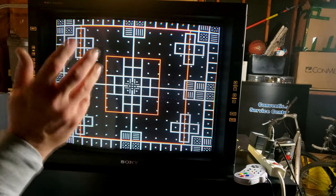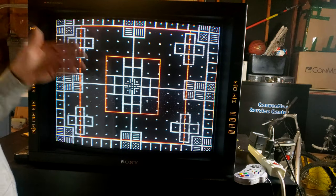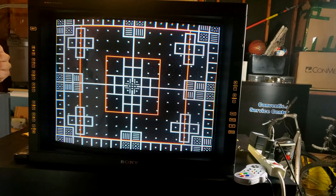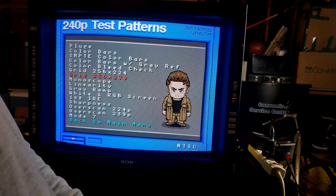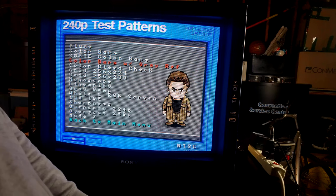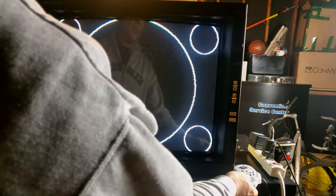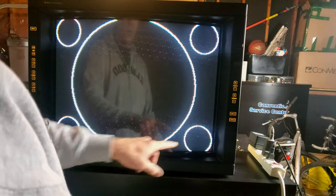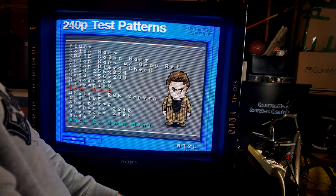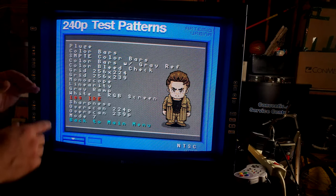And so if you're going to be looking at your geometry all day, this is not really the best monitor to have for this. Another reason is it's so difficult to make an adjustment like I showed you by taking the shell off and then adjusting those potentiometers. But this is what I would consider a well adjusted screen here. We'll look at some other things. You'll notice a little bit of issues here, just not the greatest pin controls on this monitor. Here's our linearity. And again, we have convergence issues at the top mostly. These two corners are better, but not perfect. And this is just the nature of the beast. The larger you go, the more difficult time you're having with your screen.